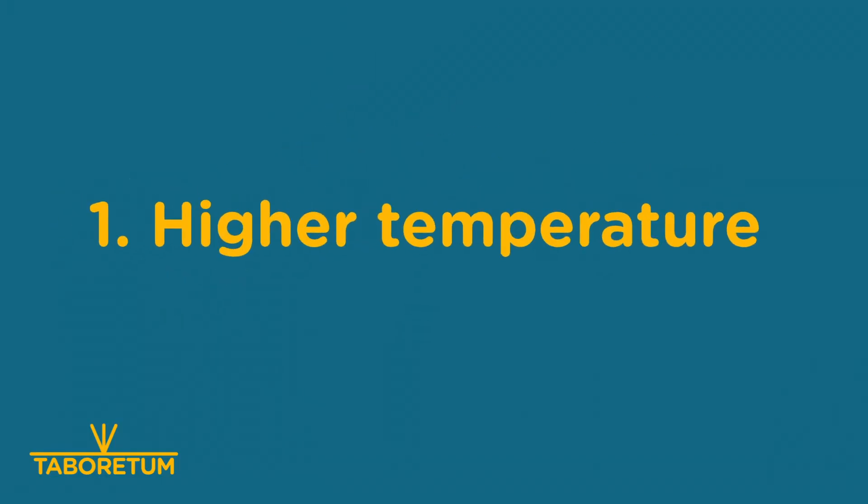So what we want to do, first of all, we want to go slightly higher with the temperature. Because you want the plastic fully melted and you want a very tight bond between layers and between lines. So first thing: higher print temperature. If your manufacturer says PLA is 185 to 210, go to 210 if it's not stringing at that setting — go to the high end of the temperature range. Temperature, number one.